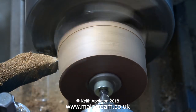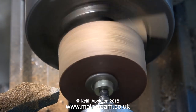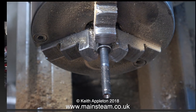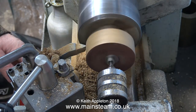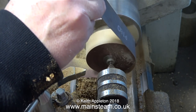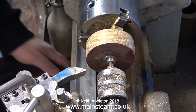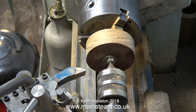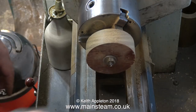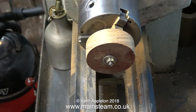And then it's time to do some mahogany turning. Mahogany turns very well with a very sharp lathe tool — you do need to make sure the tool is sharp though. Checking frequently with a set of calipers is a good idea, because I don't want to make it too small, otherwise it's back to the drawing board. That's one done. Then I fitted the next mahogany blank and did the same with that. I finished off the outer edge using a piece of emery cloth. When doing a job like this, the mahogany makes a lot of dust, so it's a good idea to wear a breathing mask. I'm using my trusty Henry vacuum cleaner to clean up the lathe, because all this sawdust over the lathe is very bad for it — it soaks up the oil, and the lack of oil is going to be a problem.